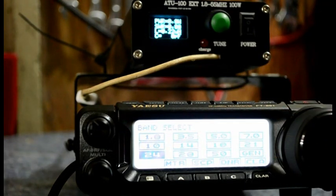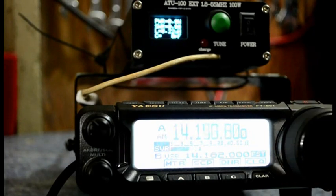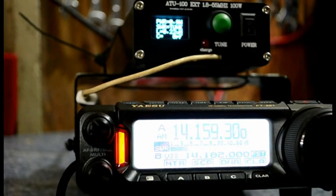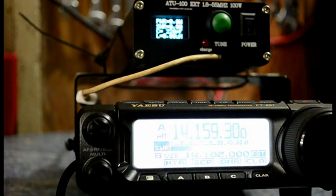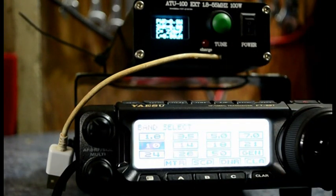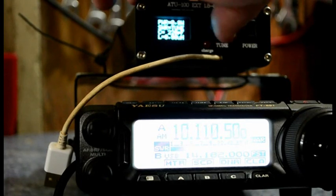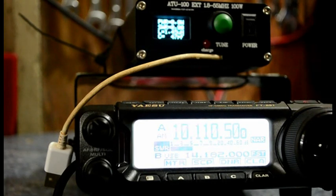Different band — we'll try 20 metres. It's already set on memory, just trying to clear so you can see. Let's see, it's tuned there — there you go, 1.4. Remember there's no power in here, but I'm going to show you a trick later. We'll try 10 metres — it's already set on memory, you can either hit reset or tune. It's done — flat 1.1, that's quite good for an HF360 on that band.